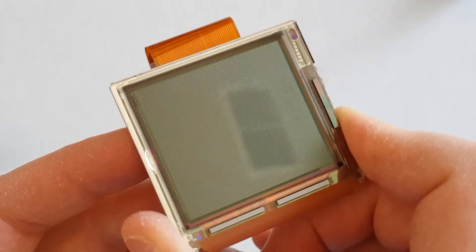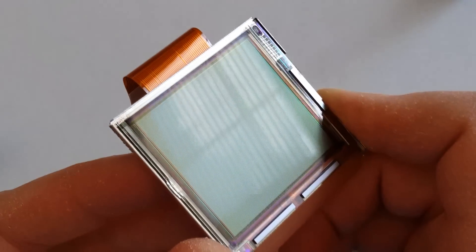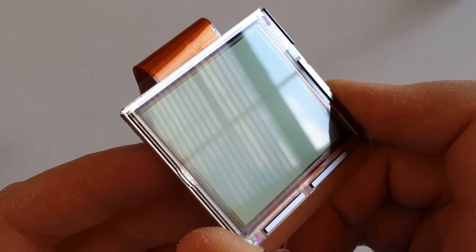So this got me interested in the Game Boy Color. Until recently — within the past two months or so — there weren't any mods that would allow you to backlight the screen. The Game Boy Color screen is reflective and mostly opaque, so that it can reflect from light sources around you, and it doesn't allow easily for actually placing a backlight source behind the screen itself.